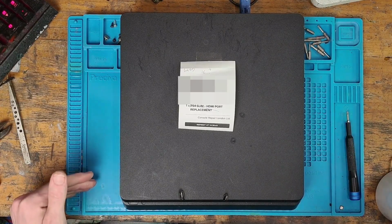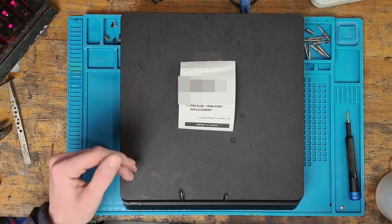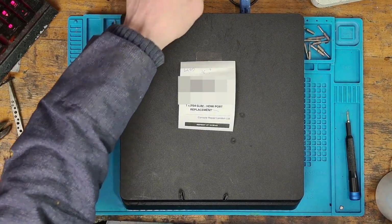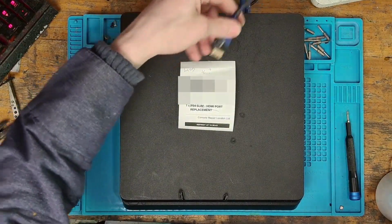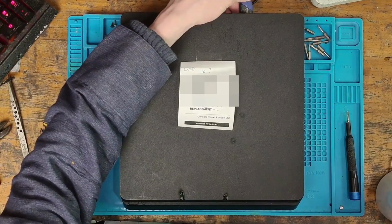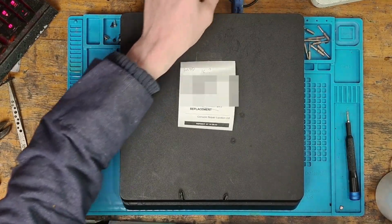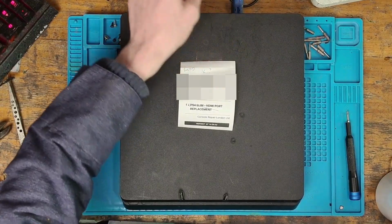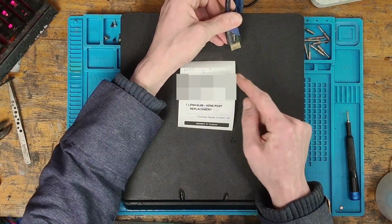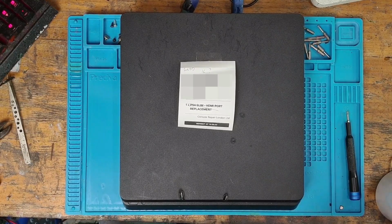That's the most common cause, and what usually happens is either you'll get a power surge down the HDMI cable from the TV, you'll get an overheating issue which will cause it to burn out the chip because the chip gets too hot, or the user constantly plugs and unplugs the HDMI cable. Because the HDMI port is on the back of the console, the user will tend to try and plug it in blindly like this, and they'll sit there messing around trying to get it to plug in, and they'll end up shorting the pins out because they've plugged it in incorrectly. Or in this case, they'll plug it in on an angle and one of the pins on the port will touch a place where it's not meant to. For example, ground will touch the data lines.